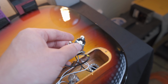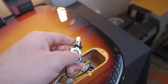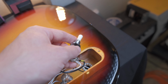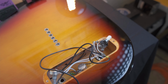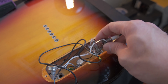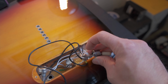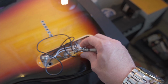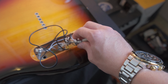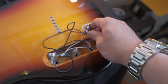And the thing is that it has little grabber things where the post can go into, right? So it's not being grabbed, and then you push it over here, and it gets grabbed by the little plastic tongs. Now, this is fine, but the problem is that over time, that's definitely going to cause dust, and the great enemy of these switches is dust, because dust will get trapped. So if you leave it in the bridge position, you can see right through the contacts, right? So there's a contact here and a contact there in the middle, and dust will settle on those, and then when you go to put it in the middle position, they're not being forced together as hard, or you put it to the other position, and again, dust can get in between and cause issues, that horrible crackling or just the switch not working.